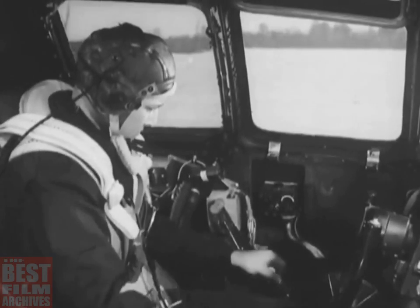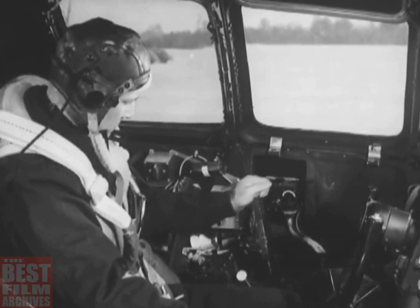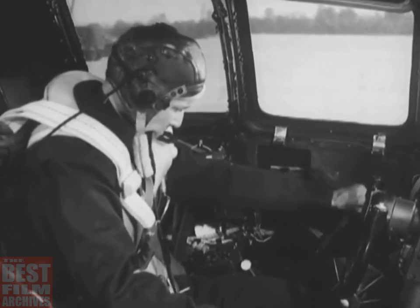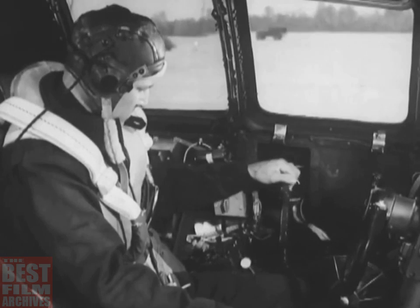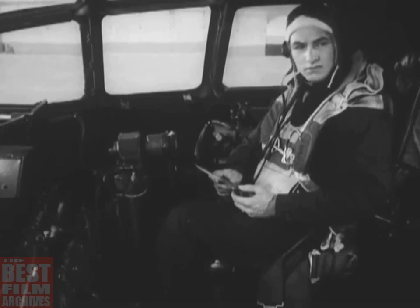Now unlock the control surfaces and throttles by moving the locking lever on the aisle stand full forward. Then release the throttle brake and test all four throttles through their entire range. Take it easy, move them slowly and gently. All controls on the B-29 should be handled in this careful manner in order to prevent damage to the mechanism. There's no need to push hard.